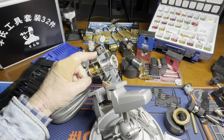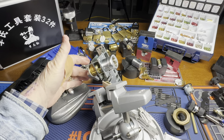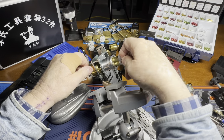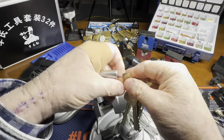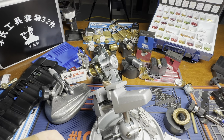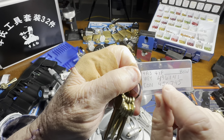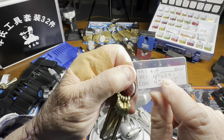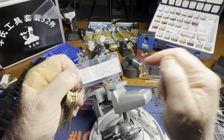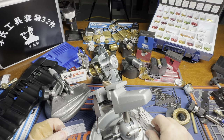Let's slam this thing into a lock. This lock is an aluminum storefront lock — it has a thumb turn that pulls it back on the inside. Pull this lug back, stick the cylinder in. Now we have a six pin in there. There's the seven and the six — they both go in the same mortise housing. There's the bitting on the key right here. The change key is a 4-9-6-1-4-1, starting at the tip — that's the deepest pin inside this cylinder.